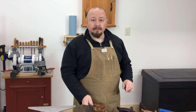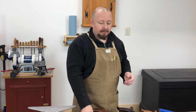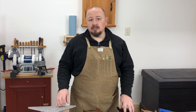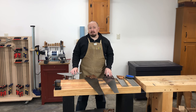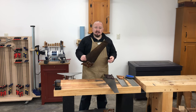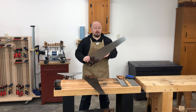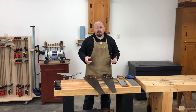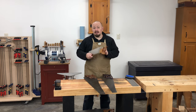If you start with a good saw with well-shaped, evenly spaced teeth, maintenance sharpening is all that saw should ever need. What saws are good to practice sharpening on? Lots of them, really. If you have an old saw with well-shaped, evenly spaced teeth that are just dull from use, that's a good saw to work on. If you have a moderately priced new saw that just has dull teeth, that's a good saw to work on too.